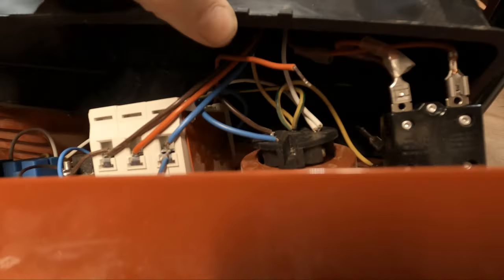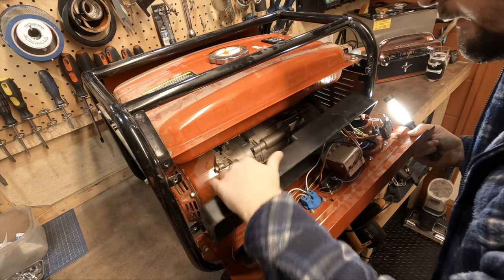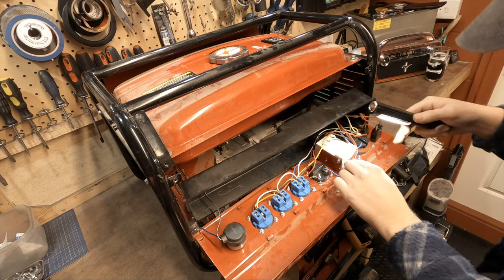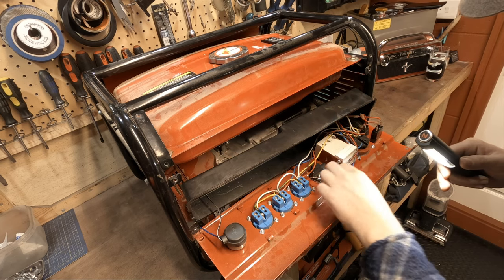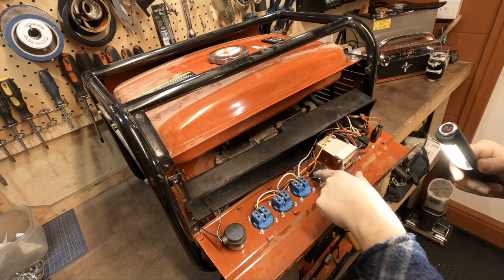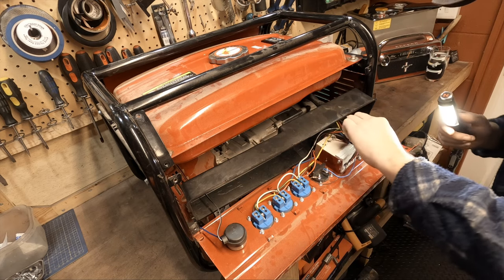You can already see a wire is missing there, which isn't good. That should be attached in there, which it is not. So this is the switch, and that is connected and that is grounded, so that should be fine. This is your circuit breaker and they're all attached into the circuit breaker. This one is missing from L3, but that won't affect the output because that is only for this plug. The voltmeter is attached, so this is going in from the generator into the bottom and out the top.